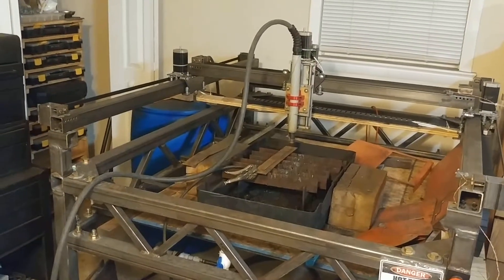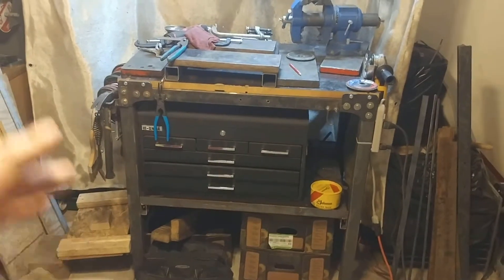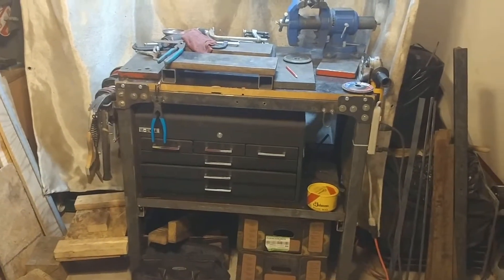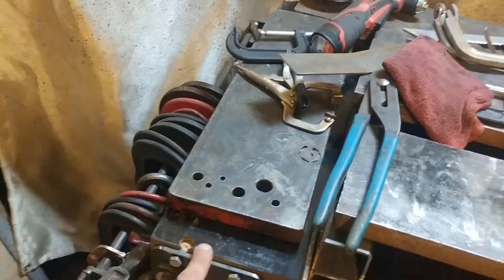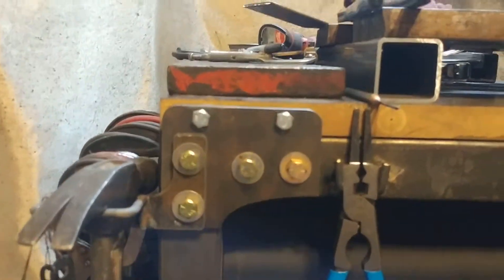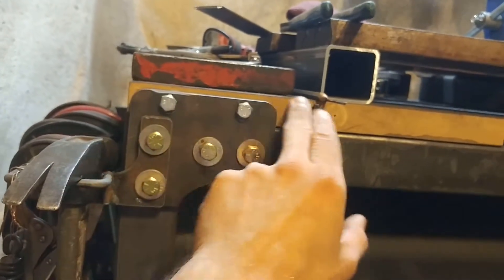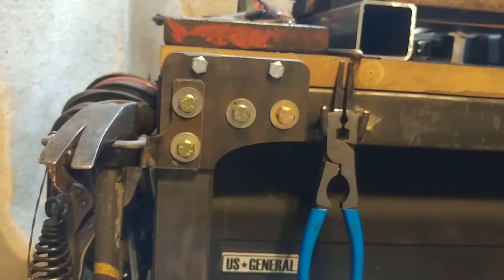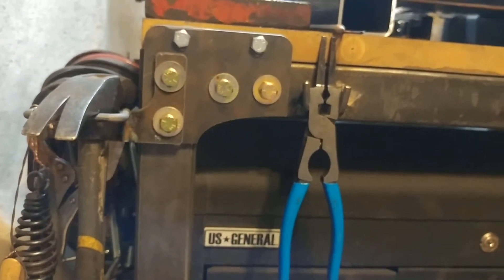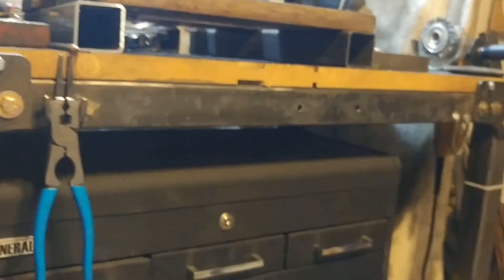As for stuff I've been cutting with this thing — I have a new workbench! If you've seen glimpses of the old one in prior videos, that was just a steel box on sawhorses — definitely a pretty ghetto workbench. But this is actually nice. The brackets here in the corners are the first things I cut on the CNC machine that were not a test cut. There's an artistic curve down here — I used a spline — and fillets on these corners. That's a few more seconds of work to make it look way nicer, which I never would have done if cutting by hand. On the CNC in FreeCAD it's another minute of work, and then that gets replicated on all four brackets — which is really the advantage of the CNC.